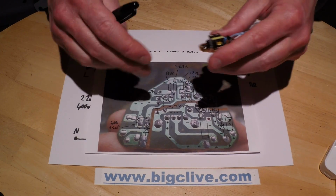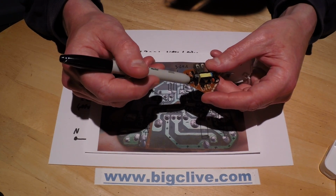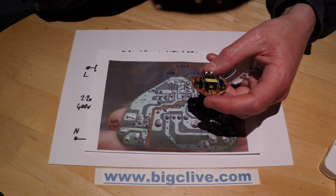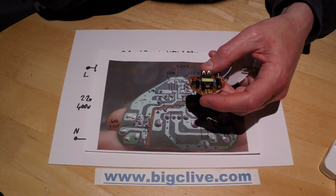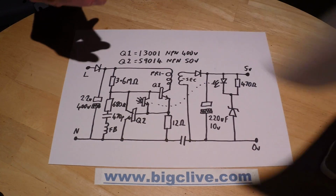But on the other hand, it's quite nice that they've included this opto-isolator. There is proper feedback. And under loading, the voltage started off around about 5.3 volts and it did drop, but not a huge amount. I would have guessed that 500 milliamps is what I'd be comfortable running a power supply like this at. But yeah, you know what, for $2, it's surprising.